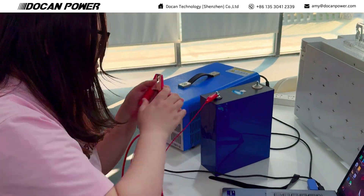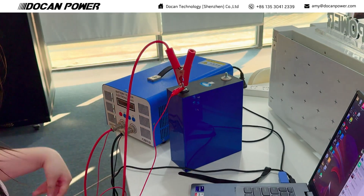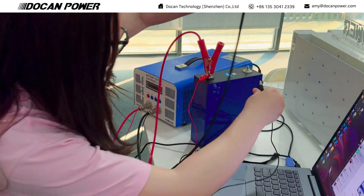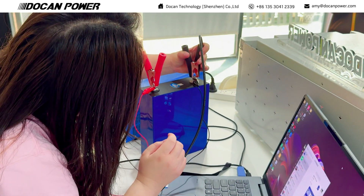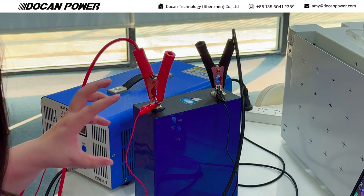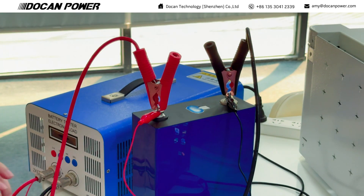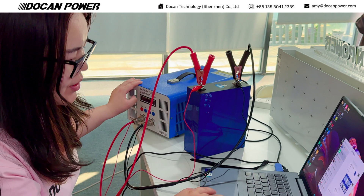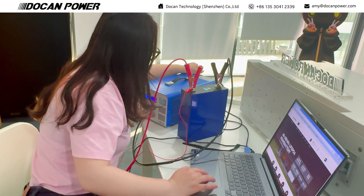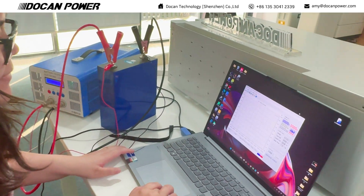Just connect the red wire to the positive terminal. Between the big wire and the small wire, just leave some space — don't let them touch together — as this will affect the internal resistance and influence the testing capacity results.